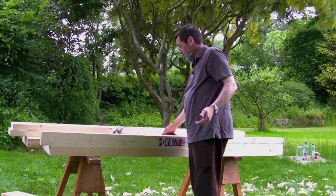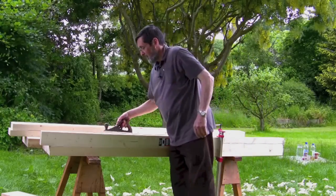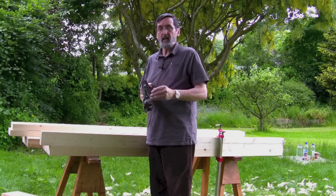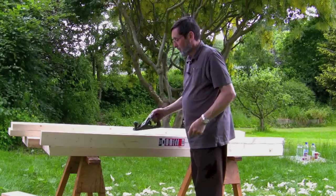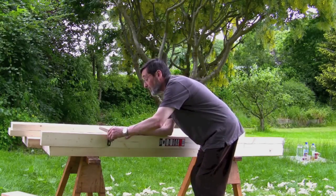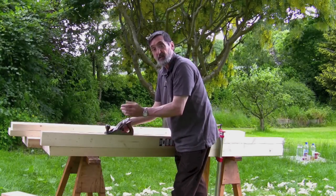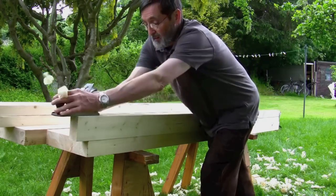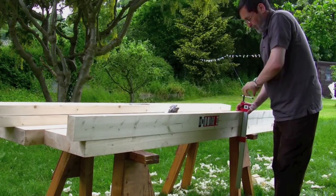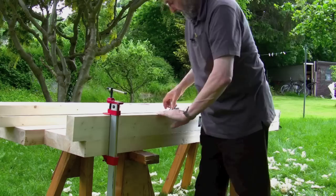First of all I want to make sure this is fairly secure — I could just sit on it but I'm going to clamp it down. I'm using a number four plane again; you won't see me using any other plane. I'm trying to avoid the wider planes because this is what you're likely to have at home, but you will have to learn to sharpen it and set it up properly. I want to take a shaving off here and find out if my machining from the lumber yard was square — usually they are square. If my plane is registered properly against the surface it should give me a clean shaving, so here — just one shaving evenly off both sides.